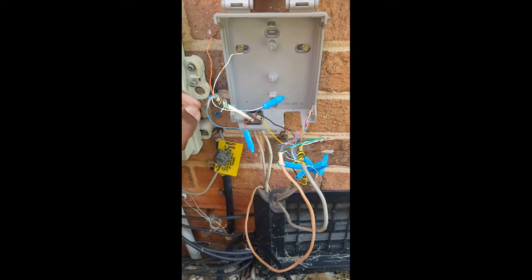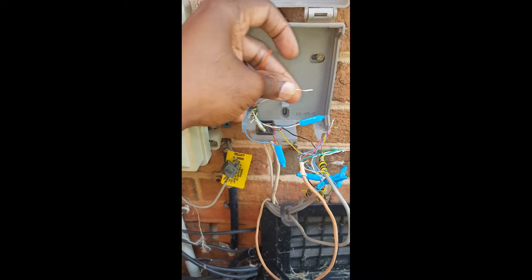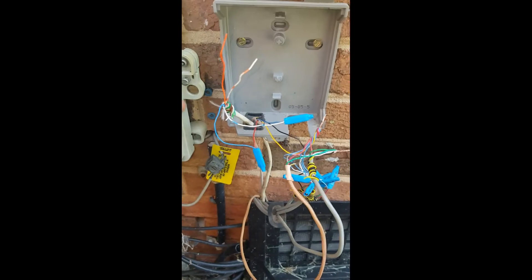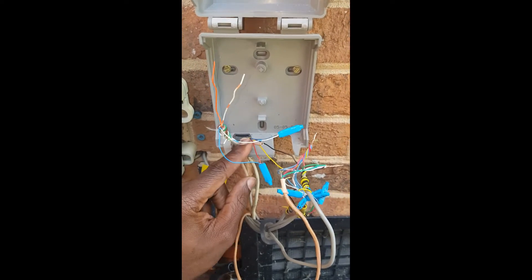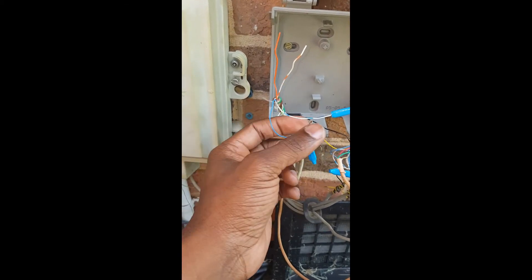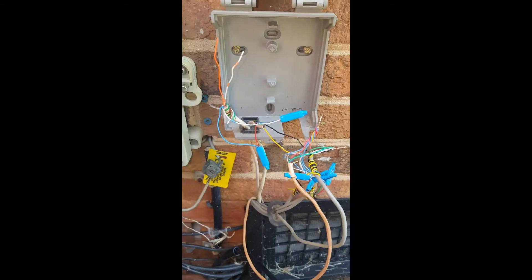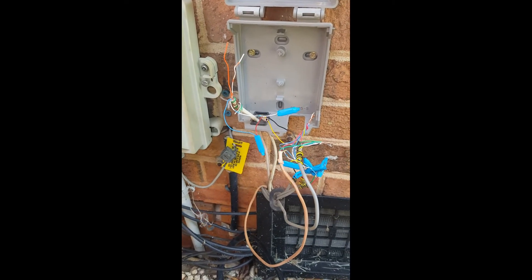As you can see all of the house phones are here, the MTA is here, and the security is here. If there was a phone where the MTA is, I would be utilizing these two guys — they'd be hooked in with these guys, beanied together. When I opened it up all of this was just jammed in here, so I pulled it out, cut it loose, separated it, and determined what was what. Once you know where your dial tone is coming from and what color the security line is, it's a lot easier. If you don't have security, you'd just hook all the blues with the blues, and the white-blues with the white-blues. I hope you guys learned something — let me know if you want me to do different videos on other phone techniques. Have a nice day.